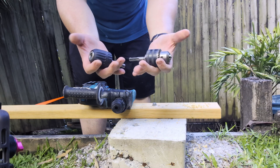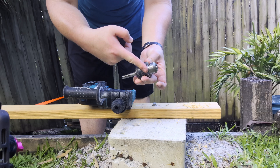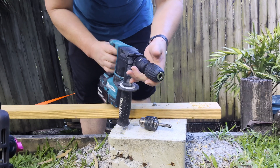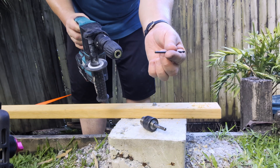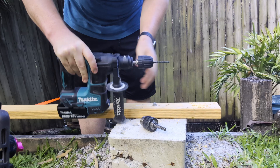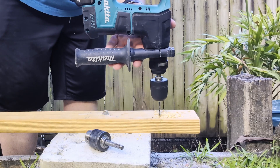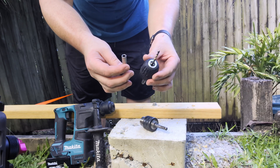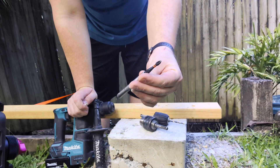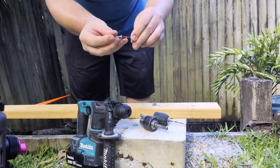If you want a more reliable kind of experience, you can use one of these adapters — they're both SDS on one side, and then a drill chuck on the other side. They commonly come as keyed ones, which are a bit old school, but you can also get keyless ones. These can take a hex shank or any round shank drill bit as well. And you can also use that for driving screws — any tool with a hex shank, including little driver bits. So now you can use your drill as a screwdriver — it's not very practical, but you can do it if you need to.